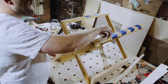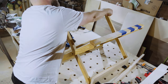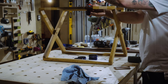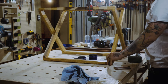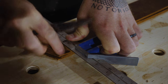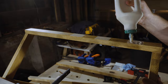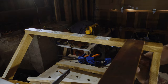After adding my finish off camera — because, frankly, finishing is boring — you can see where the tape has protected the wood. I measure and cut the leather straps for the top of the rack using a square to keep the end nice and straight. Then I apply a healthy amount of wood glue to the wood — yes, wood glue glues leather to wood very nicely. That was a tongue twister.